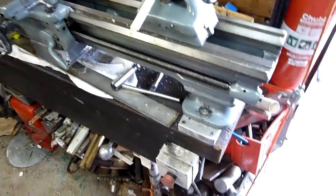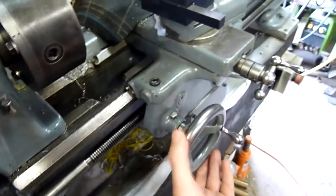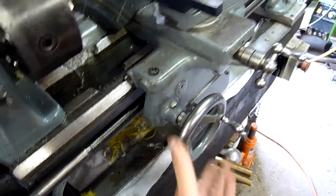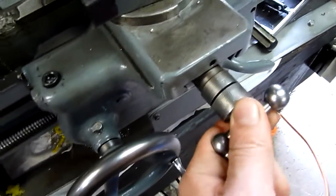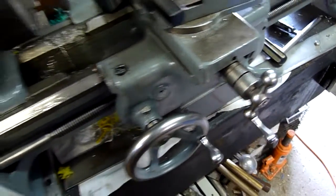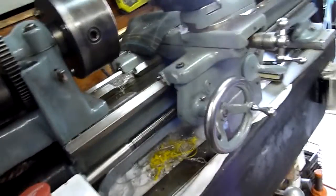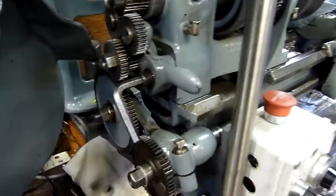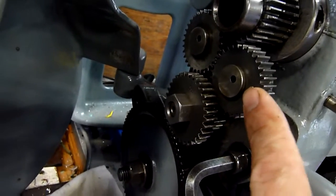That's basically all I'm going to do to this apart from maybe upgrading some parts. I'm going to get a new saddle pinion and bull gear — the teeth are worn very thin and there's a lot of play in it. I've taken some of the slop out of this one. I just need to make a brass shim to take the rest of the end float out. Back gears work, half nuts are okay, lead screws are okay-ish — there is wear and tear in it, but parts for these are quite expensive. Some of the little stud gears are quite worn too.